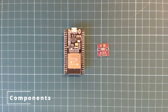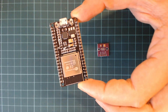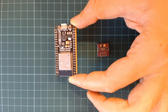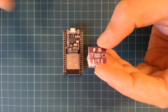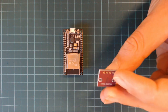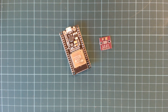The ESP32 is a low-cost, low-power microcontroller with integrated Wi-Fi and Bluetooth. We are going to use it as a microcontroller board that will allow us to connect to a Wi-Fi signal to perform tasks over the internet. In this application, we will use a 7-euro cheap board to send data from a small digital sensor board that combines the AHT20 humidity and temperature sensor and the BMP280 pressure and temperature sensor over the internet, to monitor data from our house, garden, or anywhere with an internet signal available. All links to the hardware and code will be available in the description.